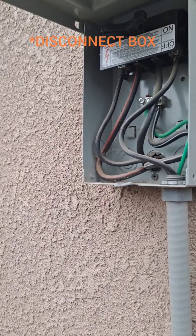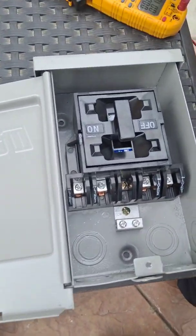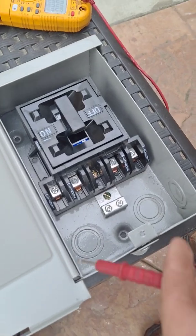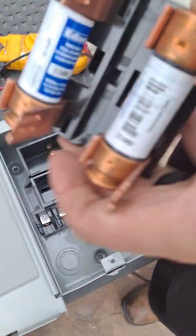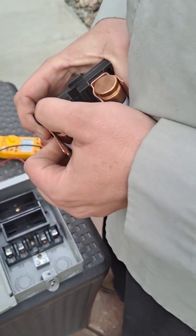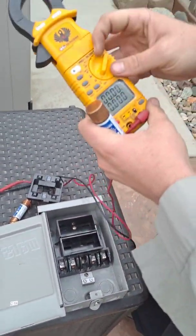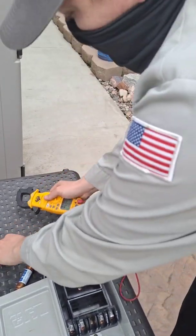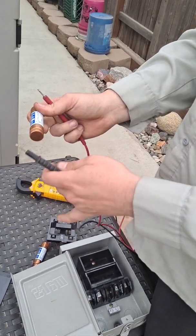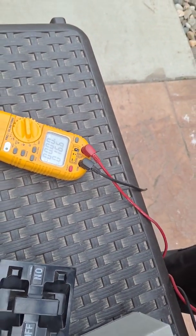So that's how you check voltage on a non-fusible disconnect. Now when you deal with a fusible disconnect, it's going to look a little bit different. I've got one right here that's not live, but basically this is what it's going to look like. You're going to test your volts across your lines and your loads. But then you'll also pull the disconnect out, and while it's out, you're going to pop these fuses off. Then take your meter, turn it to ohms, and check the continuity between these fuses. You take one lead, touch it on one end, and touch it on the other end — and you'll see we have continuity through this fuse.